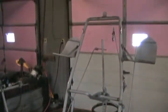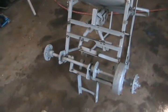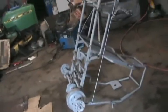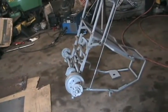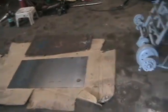There's the frame. I just got done using my welder to make all kinds of little touch-up welds, as you can see. It's hard to believe, but when I made that thing 32 years ago, I never even heard of a MIG welder. So even though it's thin-walled pipe, I stick welded it all together. After the sandblasting, there were little slag inclusions, that crap that you can't beat up with a hammer. And now that it was all blasted out, I could see holes in my welds, so I went and touched them up. Now to cut that thing out.